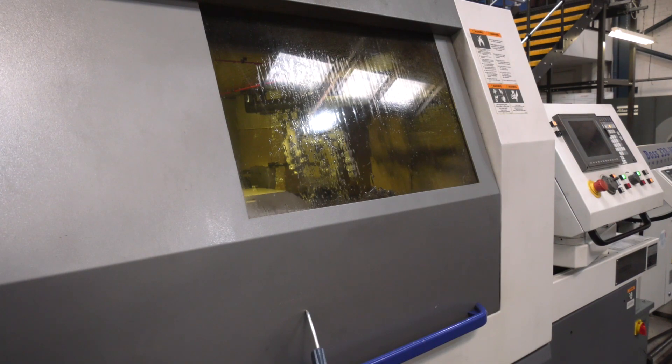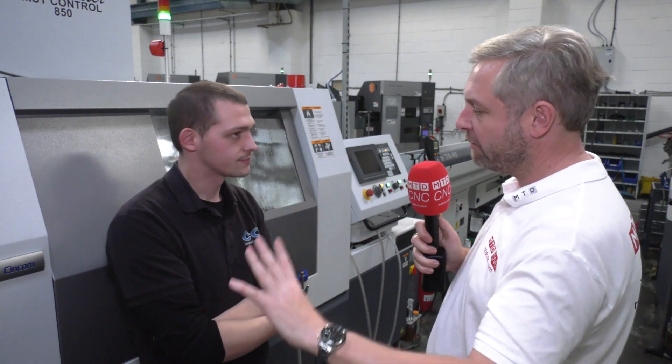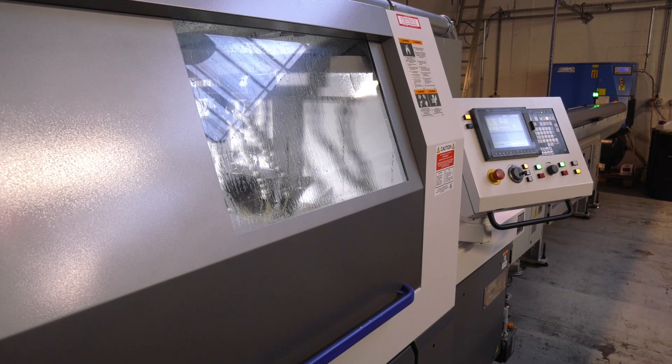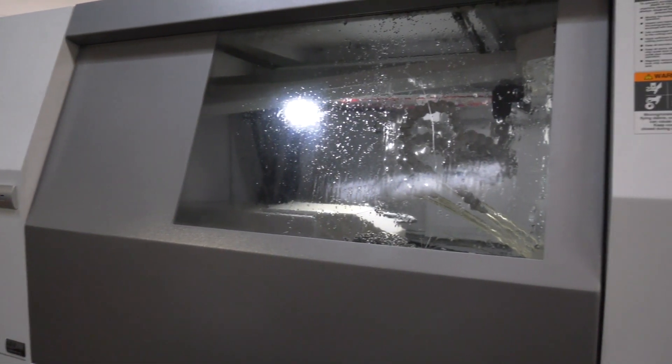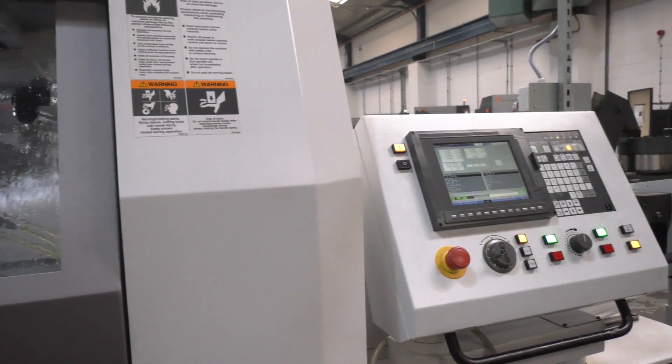The big question is the LFV — you had to buy the L32 for another contract, so why did you buy the LFV version? Really it was because we wanted the machine to be more efficient, able to do a bigger depth of cut with a better surface finish. It works for some inserts and some different cycles — roughing or finishing — but you find it works on some things and not others. Once you start to learn that yourself you learn to optimize the LFV. We had a short LFV training session — they explained it within five minutes and within the next five minutes we knew how to use it. The tooling suppliers are also learning more about it themselves and they do offer support, so we'll just improve and improve.